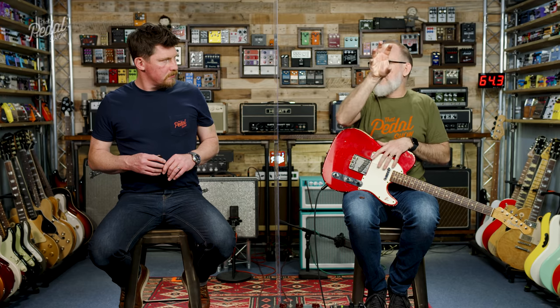I think what Benson have done, they found a really clever way to have a lower output impedance and buffer the input circuit. So it all sounds great. It still works with the volume control. We're going to do that next, yeah. But you can see the issues that would instantly arise using a traditional fuzz face circuit in a pedalboard where you want things going on after it and things going on before it, but you also want to have it by itself.